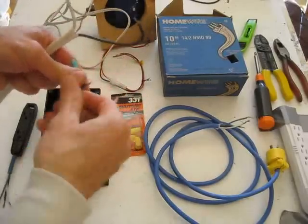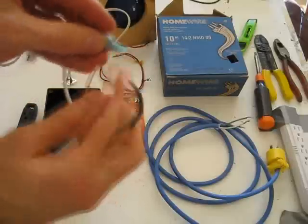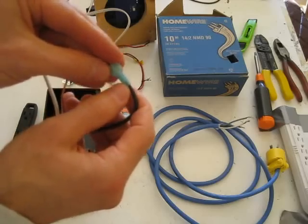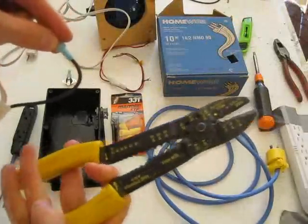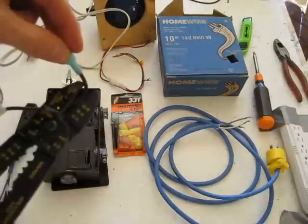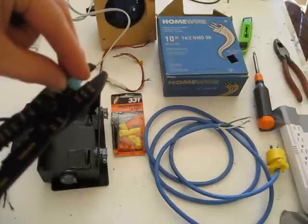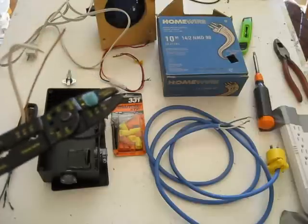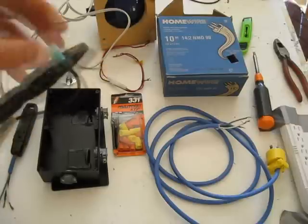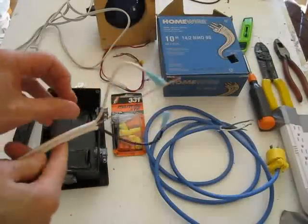To connect the terminal disconnects, trim the wire to about a quarter inch, so the copper part is firmly inside the metal collar of the terminal disconnect. Then use a crimping tool — it has different size settings: red for 22 to 18 gauge, blue for 16 to 14. Since this is 14 gauge wire, use the blue crimping part. Simply place it over the metal collar and squeeze hard. These crimping tools come in various quality levels; this is a medium quality one that does the job. Both terminal disconnects are now done; just bend the ground wire out of the way for later use inside the solar air heater.